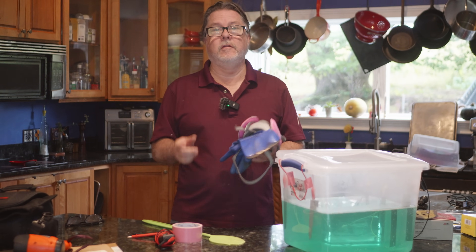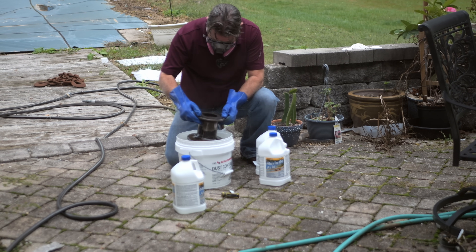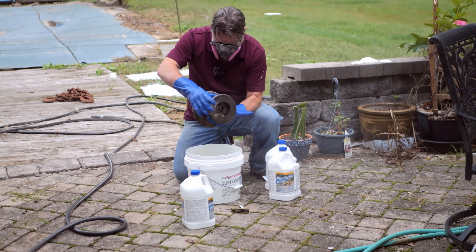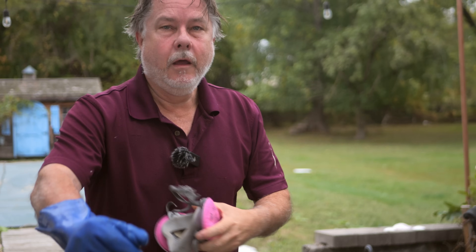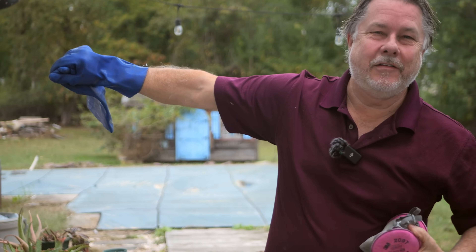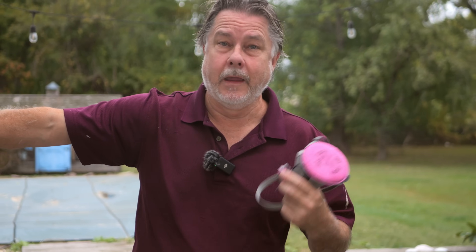It has been 16 hours since we put the capstan into the muriatic acid. It's working — it's not all the way there yet, but my hands are smoking. I'm going to give it a few more hours and then try using my pressure washer to see if I can get it off. It is starting to flake off, just not everywhere. I didn't see any damage at all to the actual bronze of the capstan, which is what I was concerned about leaving it in longer.